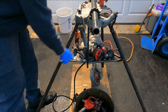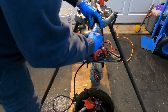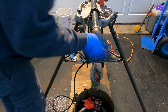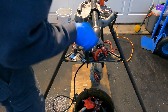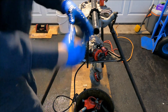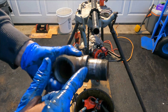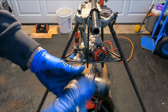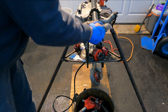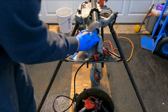Wipe with a rag, clean off your shavings. Take a fitting and make sure your threads are good. This one was no good — it went in too deep. This 90-degree fitting sunk too deep, so I decided not to use it and threw it away. It's here just for a test — it gives me a handle. But this side is good. That's it for the manual threader.